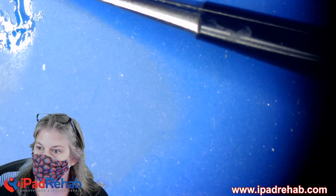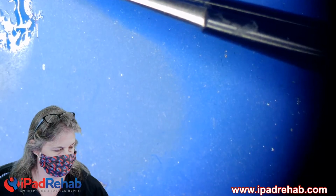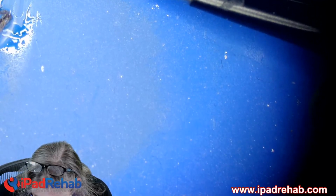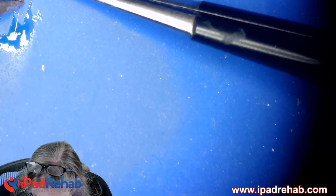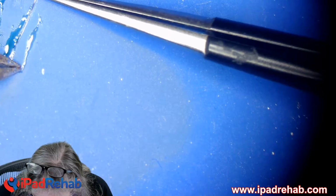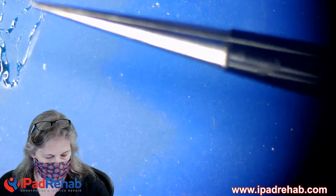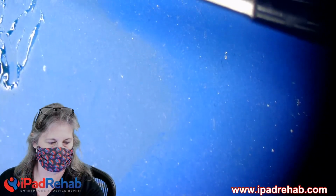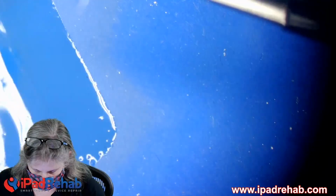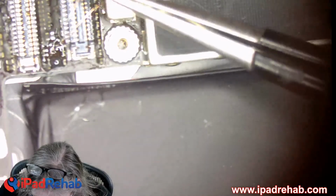You think that you need to run an external pull-up resistor? Maybe. It's open now, so, you know, no. I think it's open. I think whatever injury it had created a short that we were able to relieve, but that injury had damaged that part of the CPU. So that, I think, is not good. So what Chris, BNC Connection, is suggesting, I think, is if it were still short, could you overcome the short by supplying a different voltage down it, if it still had some slight resistance to ground? Great strategy, but that's not the deal right now, right?